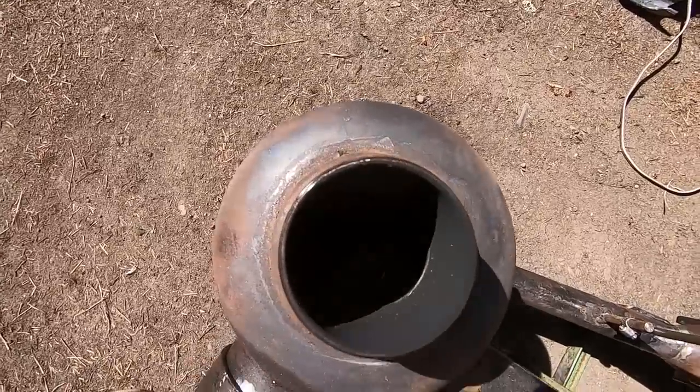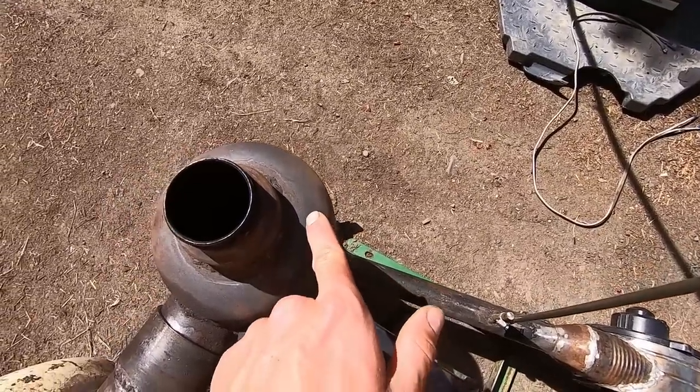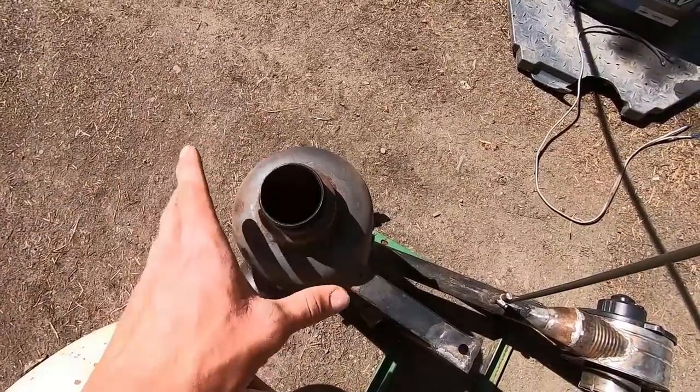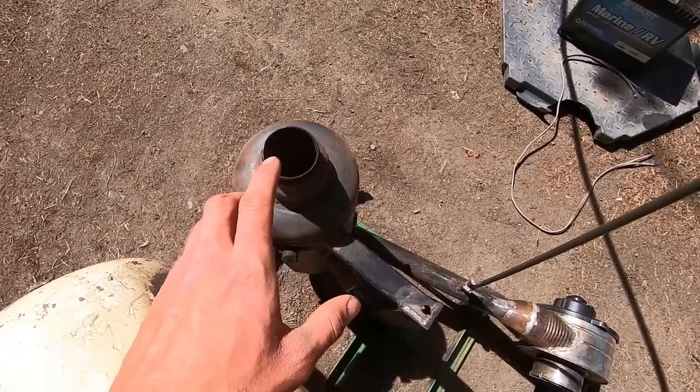And down inside of there, which is quite dark, I doubt you'll be able to see, but you're really not missing much. Basically, that tube just goes about 1/2 inch into this pipe at an angle, and that's to generate a cyclone effect in here. And that's for a couple of reasons. Number one, we wanna make sure that our oil and air are very well mixed.